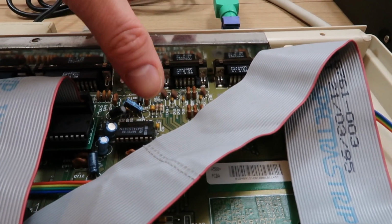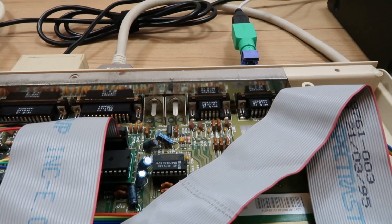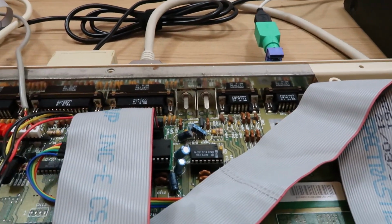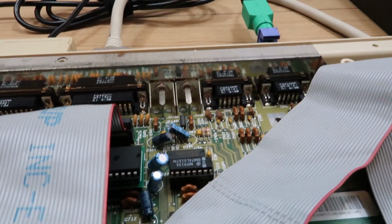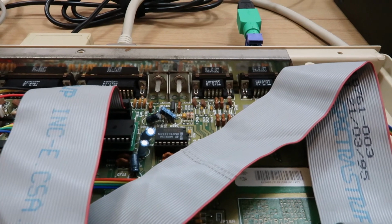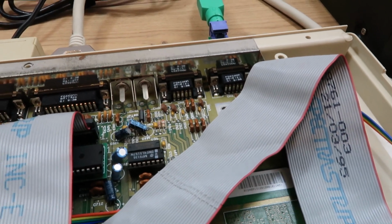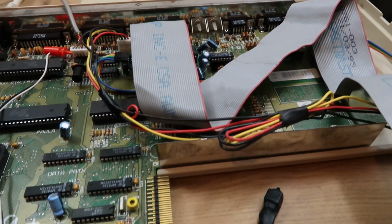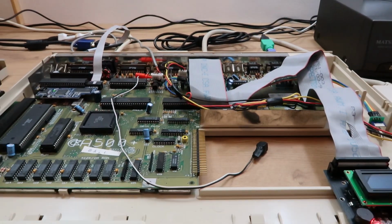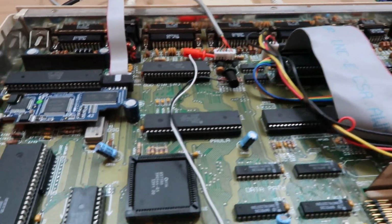So I had to steal a chip off another Amiga board that I had and hope that I could get it off without damaging it, and hope that the one on the other board, which wasn't working, that the chip was working. Luckily, I think it's fixed it. Either the chip from the other board works, or the original chip has started working again since I desoldered it. I'm not really sure. I'm a bit suspicious that this is actually the original chip, it's just started working again. So I've got to do more testing there, but at the time, we were talking a day or two before I needed to be heading off to SWAG, so it worked, move on to the next problem. So that's sort of the stage it got to.